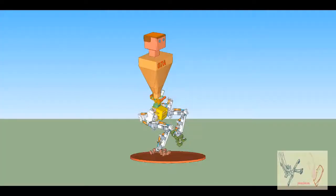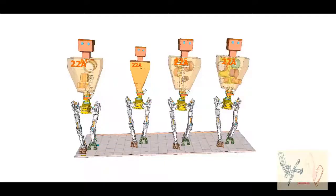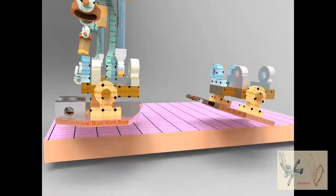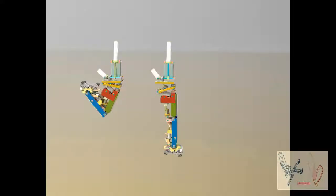The principle of operation of this engine as we've designed it is that we feel the sound that comes from an engine has two parts. The sound of the parts of the engine themselves moving, which is not a very large sound in an engine where the crankshaft is rotating slowly. The other sound source from the engine is the moving of the gases from inside of the cylinder to outside of the cylinder. The exhaust gases need to leave the cylinder, and the faster the exhaust gases leave the cylinder, the more pressure is required on them to get this to happen, and the differential pressure between the exhaust gas pressure and the surrounding atmosphere pressure is, by definition, the definition of loudness. So the faster the engine runs, the louder it will be with respect to its exhaust gases.